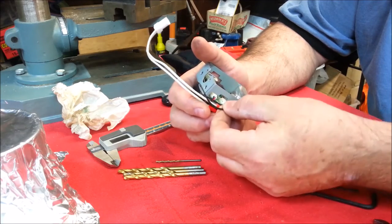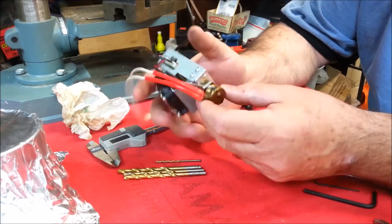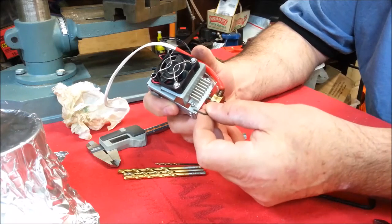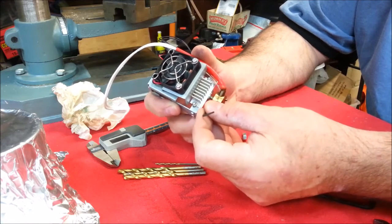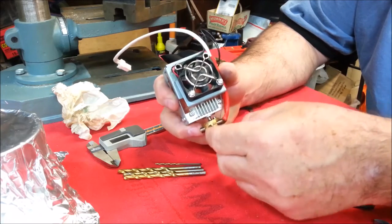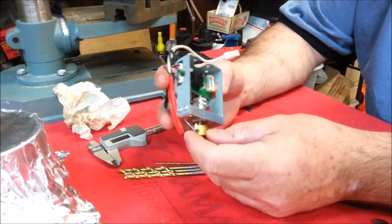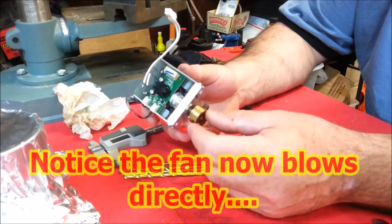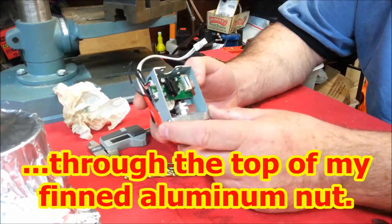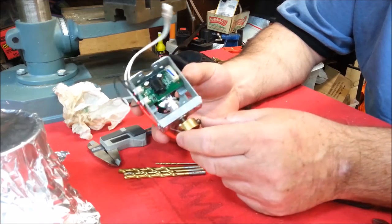Here's my temperature sensor — it gets plugged in here. And this is the 12 volts that drives the heating element. You may have noticed that was loose — I'll go ahead and tighten that up now. That's a fairly close fitting hole it's installed in. These are all metal heads, they just need better cooling, so we'll keep working on this and keep improving it. I may not install my V6 E3D head if this continues to work well — but I did spend 80-some dollars on it and I sure would like to use it and see how much better it prints.